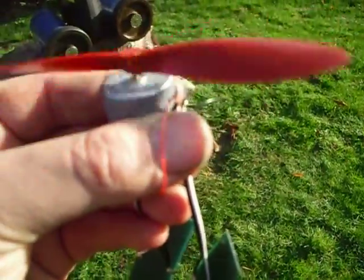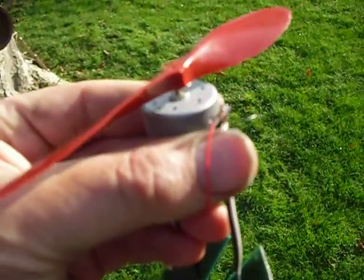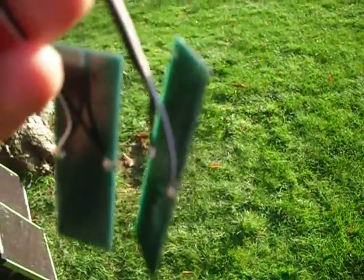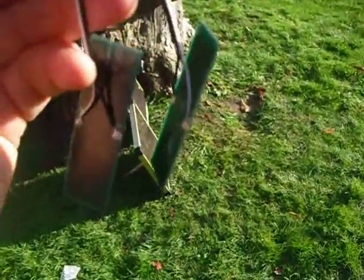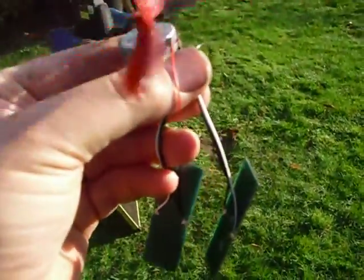So it's easy enough to imagine that motor driving a gearbox, and that gearbox would wind the whole thing around. But as well as having that panel there, you might as well have another one round here facing towards me, and another one on that side facing away. So if the sun goes down in the evening and comes up next morning, it's going to come up on the other side of the assembly. So you want to make sure it somehow gets light onto that other panel so that it winds itself back around to face the morning again.